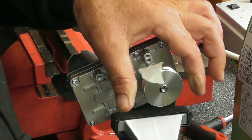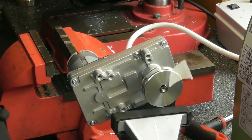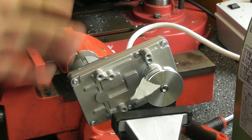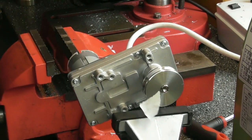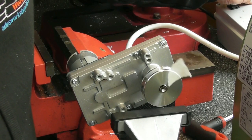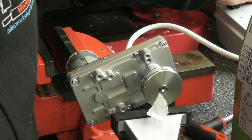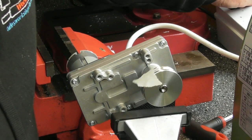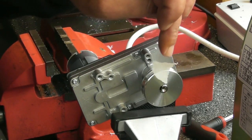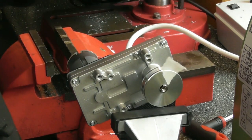And that really has got double the torque at low speed that the other motor had. So I'm quite confident when I put a 24 volt power supply into this, that it'll run from that sort of speed at slowest, and obviously speed up to the highest speeds. If I'm running out of the slow speeds, I can always reduce the diameter of the pulley a bit.